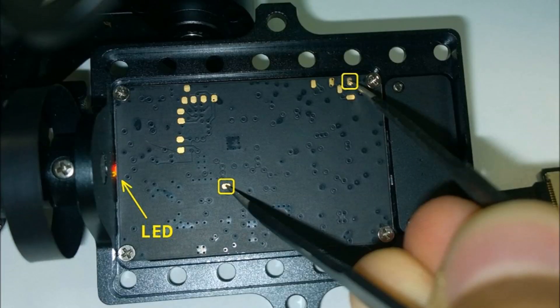As you can see here, this is a picture of the inside of the gimbal plate, and there are some gold contacts. Depending on your gimbal version you may need to remove a little cover or peel-back material, or they may just be exposed — depends whether you've got version 1 or 1.1. What you need to do to reset the gimbal is switch everything off, then short out the two highlighted pads, the little gold contacts. If you use a pair of tweezers, that's ideal because you can do it one-handed.